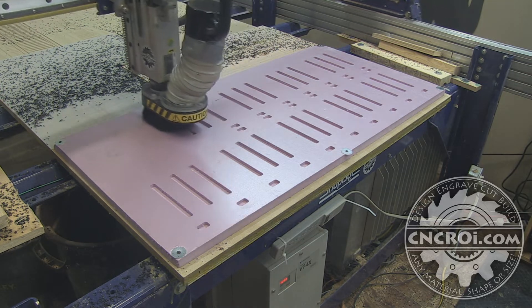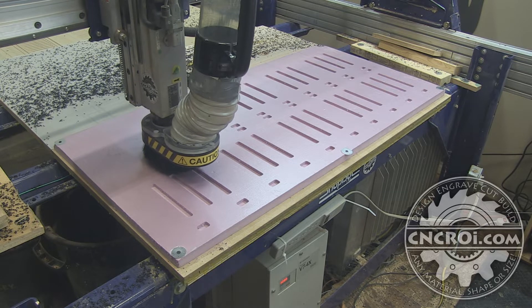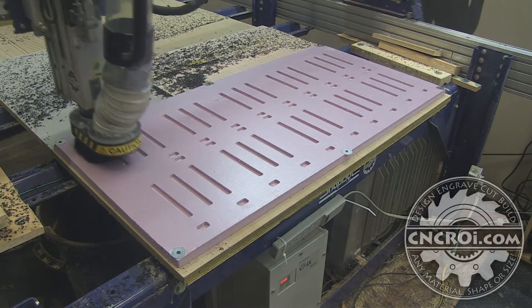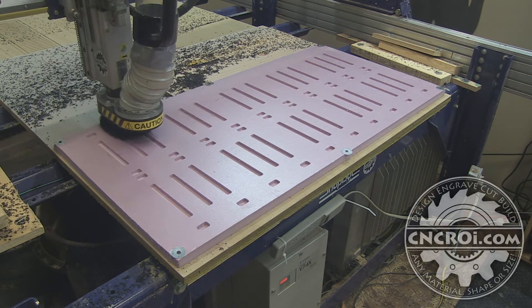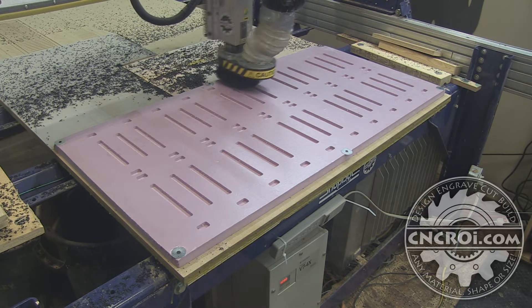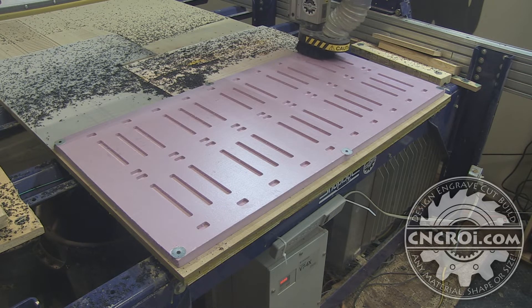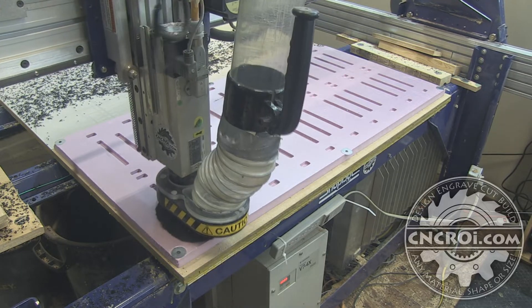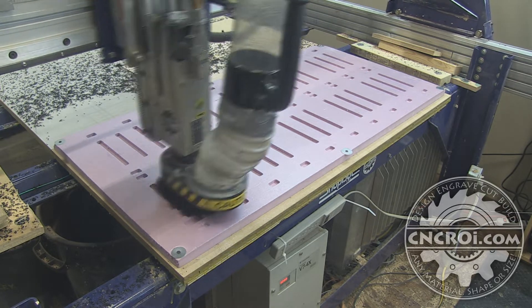You can actually see a little bit of dark particles on the top left here, and that's from a job we're doing similar to this except the material is HDPE, which is what they use for custom cutting boards. In that case there's a jig for a UV printer that we were prototyping at the time. That stuff is completely different to this — plastic cuts really well yes, but it also has a lot more flex and bounce to it. The nice thing about this foam is there's zero bounce, so it's completely flat and just stays flat. But for the application where we're using HDPE, foam just can't work — it's not strong enough to support what it's going to be doing.